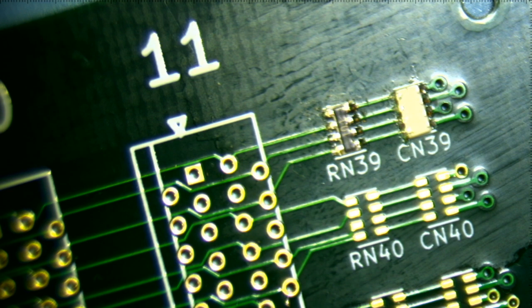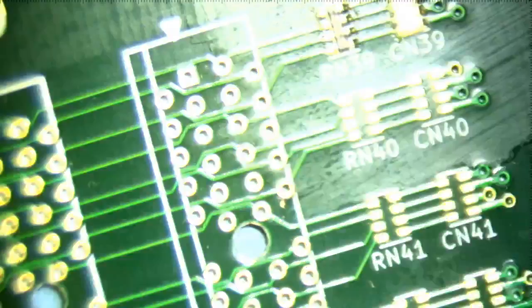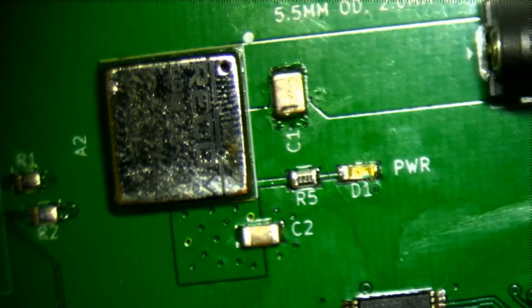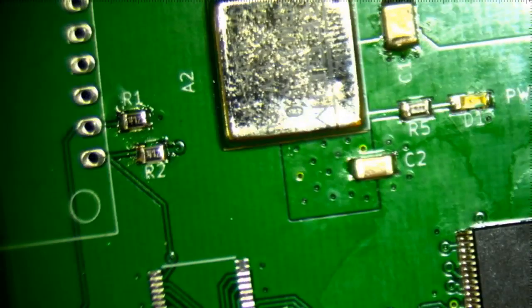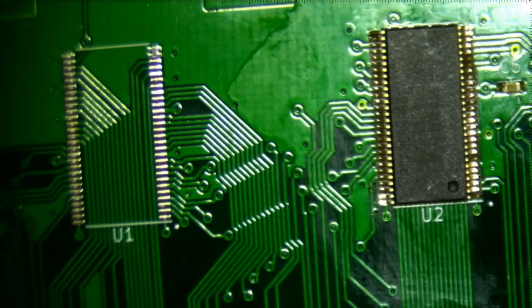So that was quite fun. So to review, we managed to solder up this neat LGA using hot air and these big capacitors, and we tested this LED, and then we soldered it in, and it worked great with the jack. So we know that that's working. I soldered in some of these passive components, and then we hit the chip, which really worked well with this chisel tip that has a reservoir in it.